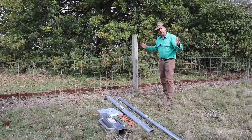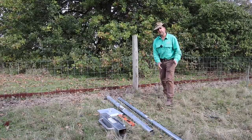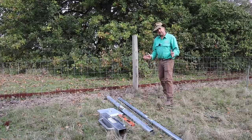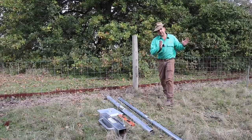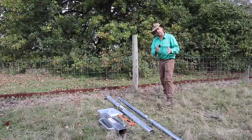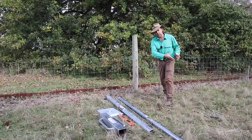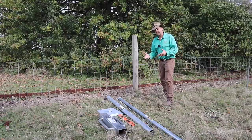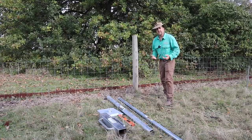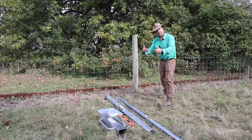So let's set out our fence line. We're going to do that by running out a wire on the pressure side of the fence. The pressure side is the side you expect the stock to be pushing against the most. On an internal fence like this one, you'd put the pressure side on the side against the smaller paddock or where the animals spend most of their time. On internal fences it doesn't matter so much, but for external fences you should always have the wire facing inwards for livestock and outwards for pedestrian traffic.